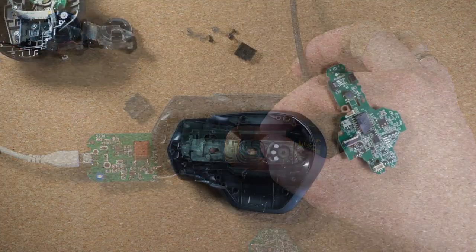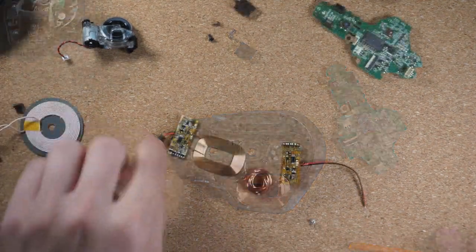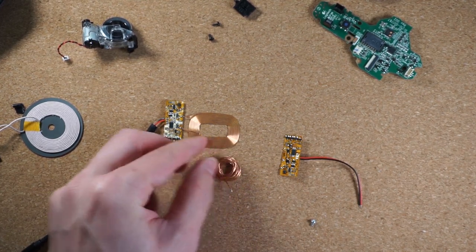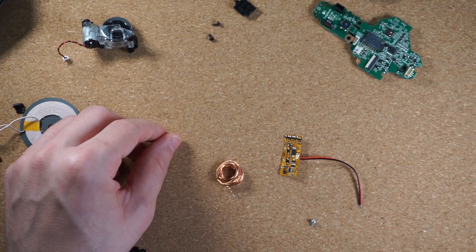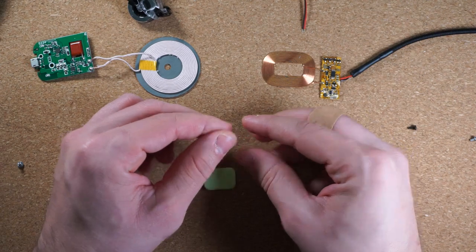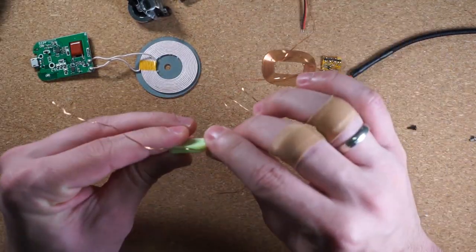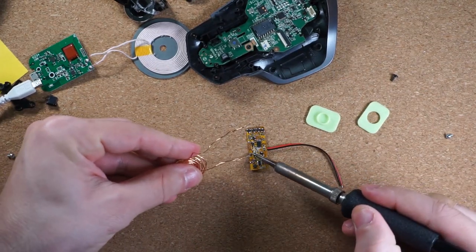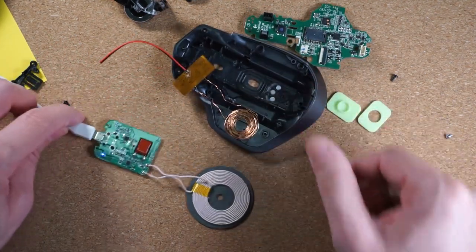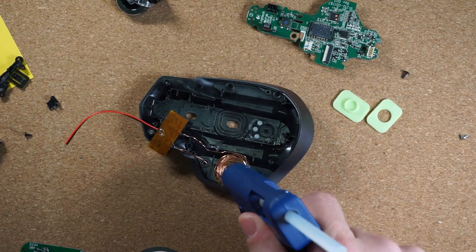I also did some testing and figured out where I want my coil to live. Now that I know where I want my coil to live, it's obvious that it's too big and I need to modify it to a slightly smaller diameter. You can do this by hand like I did here to give it a quick sanity check, but what I ended up doing is 3D printing a tiny jig to help with that. This allowed me to take this very long piece of wire, which is basically the receiver coil just unspooled, and wrap it in a bit more consistent way. Now that we have modified our coil, it's time to test if it will still work through the mouse enclosure — doing a quick sanity check. And yes, it still works. To make sure the coil doesn't move around or change shape too much, I'm going to add a tiny bit of hot glue to it.